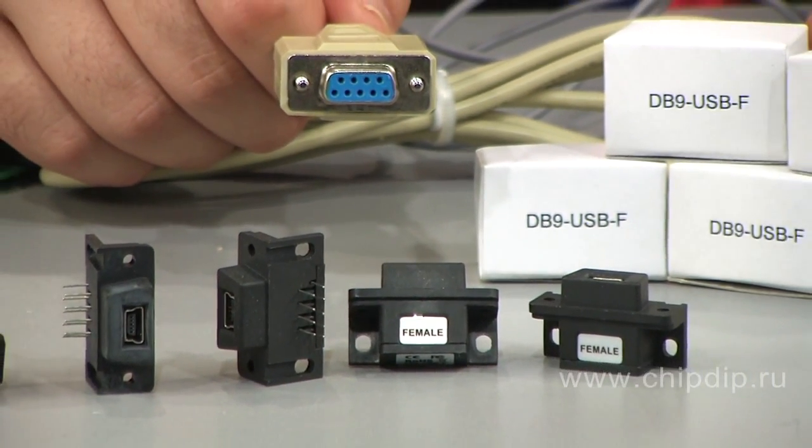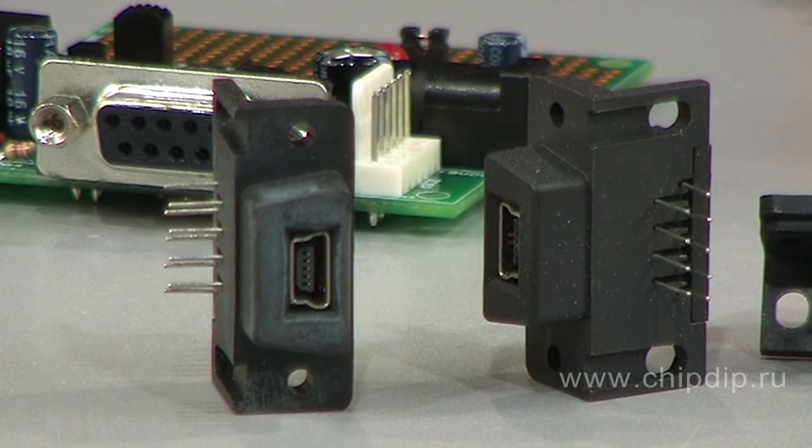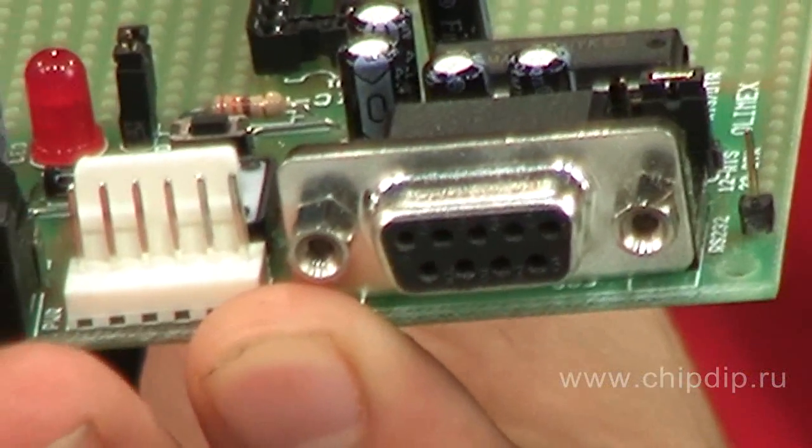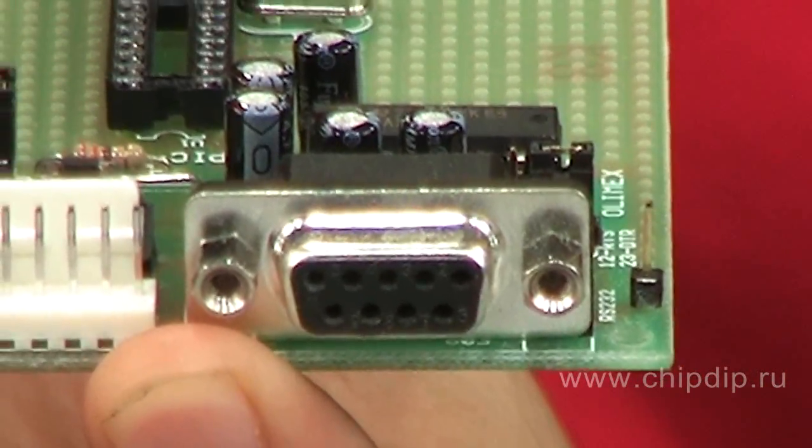The models have all electronics necessary to make transformations between USB and RS-232 inside — a USB serial bridge FT-232R microchip and level shift systems. RS-232 signals, including modem service signals, can be transmitted at a speed of 1 Mb. DB9USB needs USB device drivers available at www.ftdichip.com, enabling the system to see DB9USB at a virtual COM port. This allows existing software to exchange data through DB9USB RS-232 as an ordinary RS-232 peripheral device. The model is powered from the USB port and operates at temperatures from minus 40°C to plus 85°C.